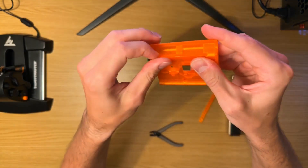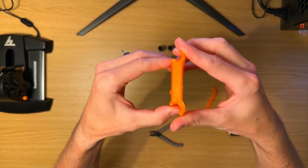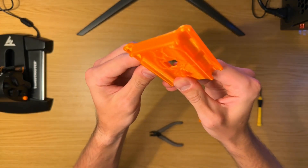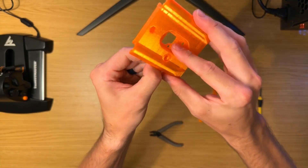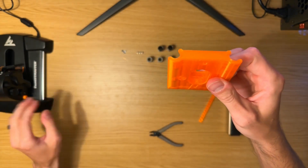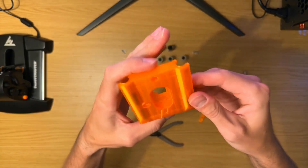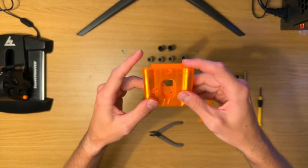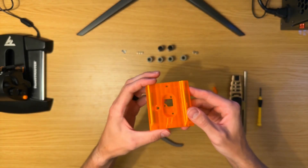Particularly on the bearing mount surfaces — those have to be perfect to get the correct alignment, to use the tapered bearing surface feature that I've put on this. That allows perfect alignment of the bearings along the rails and provides the exact amount of squeeze or tolerance I want on those, to minimize any movement of the handle in the base while also optimizing friction. It's a delicate balance between getting perfect smoothness in the sliding direction and absolutely no rattle in any other direction.